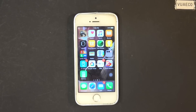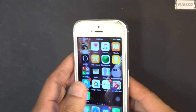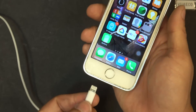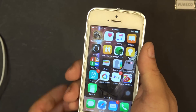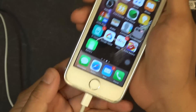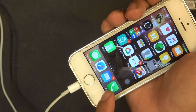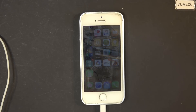So my solution for this problem is either: use this board to charge my battery and then once in a while just restart the phone so I can see the correct state of charge; or I can still use the original BMS and plug in the phone to charge it, but then I have to watch the percentage and only charge it up to about 90%. If I plug it in, I'm going to only charge it up to about 90% and no more — otherwise it will overcharge my battery again and kill the battery very quickly. That's all I have for now. Thanks for watching and I'll see you next time.